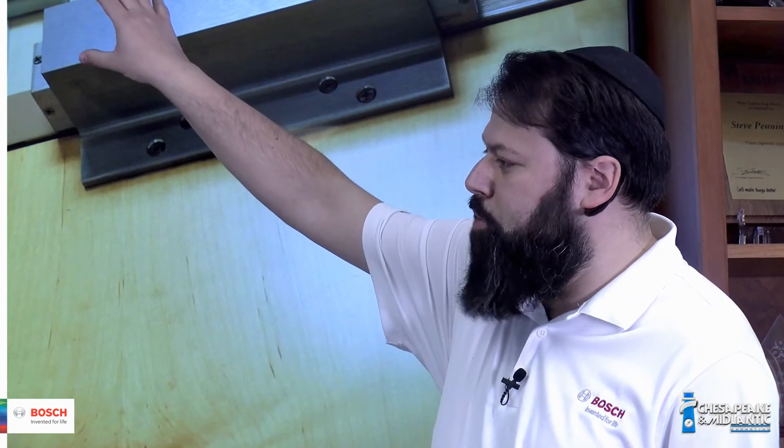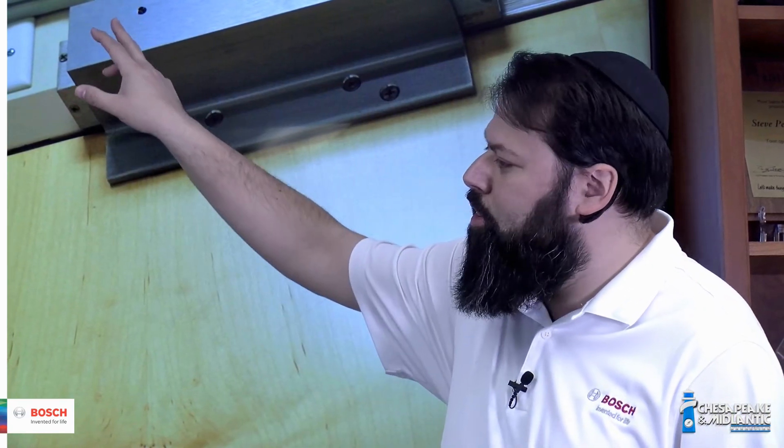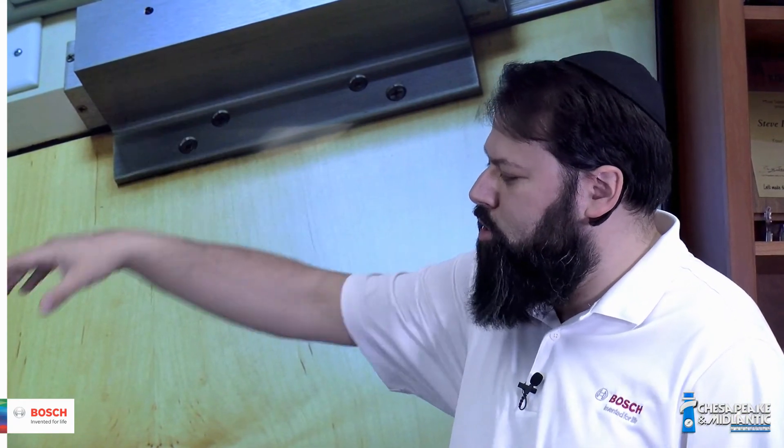So I see this particular request to exit is mounted over a door. Is there any other way to mount a request to exit? You can mount a REX just above the door. You can mount it on the ceiling above the door, as long as it's within 15 feet from the ground, and you can adjust the beam of the REX so that it just detects the area immediately around the door.